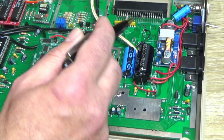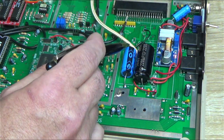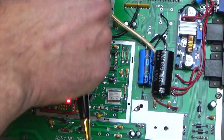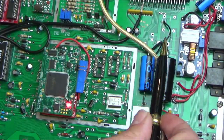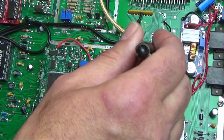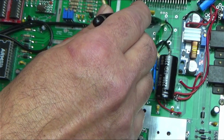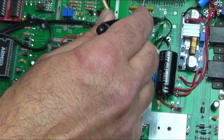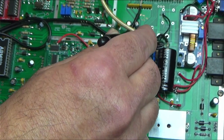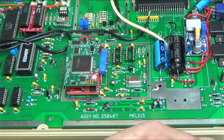The ground is hooked up over here, and on the backside, all the grounds are bonded now — because this was a completely separate circuit inside the machine. We've got them bonded here and here, and this is just another decent spot to take a wire down to. There was already a spot on the board so I figured I might as well use it.